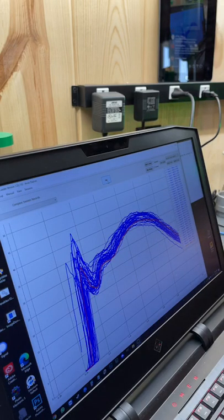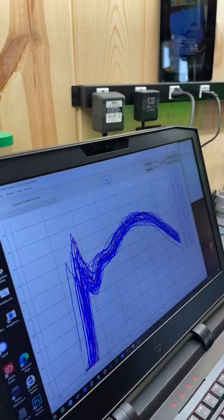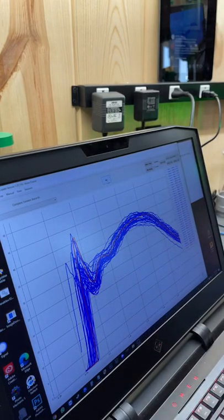And keep in mind, all I did was just throw a hand chamfer on it. And bam, it spikes really quickly and very high, much more so than these other ones that I didn't put a sharp edge on. And you would think the seating force from a chamfered bullet, or excuse me, a chamfered case, you'd think that seating force would be less, right? It would require less force. But based on what we're seeing here, that's not the case.